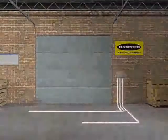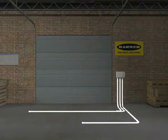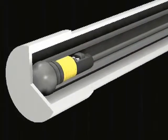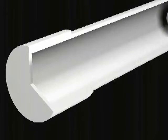2-inch PVC should be laid out prior to pouring the floor or road surface. The M-Gauge is then fed through 3-quarter inch plastic flex conduit. The flex conduit is then pushed into the 2-inch PVC until it reaches the desired sensing point. If the sensor needs to be replaced, simply pull the flex conduit out of the 2-inch PVC and the sensor can be easily exchanged.